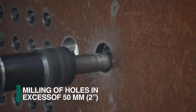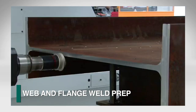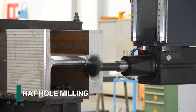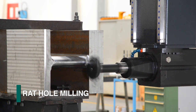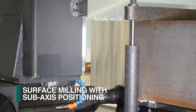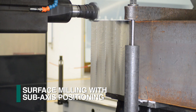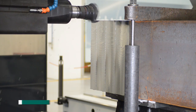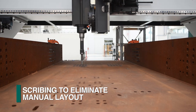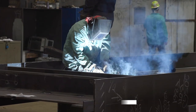Hole sizes exceeding 50 mm can be milled to the required diameter. Typical web preps can also be generated by milling the web and the flanges using proper tooling. Rat holes can be milled easily to complete the end preparation. This sub-axis capability makes the Endeavour gantry drill well suited to perform milling operations as just the spindle is active in multiple axes while the part and gantry remains rigidly clamped. This is also essential for scribing operations to eliminate manual layout of attachments, such as stiffeners, for subsequent welding.